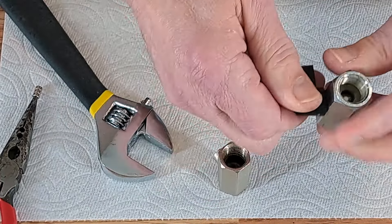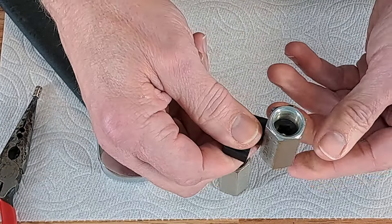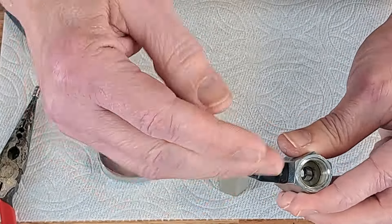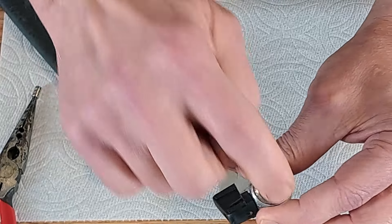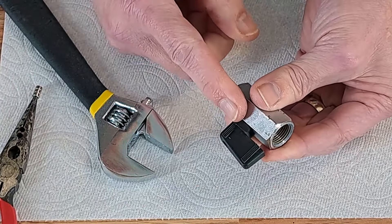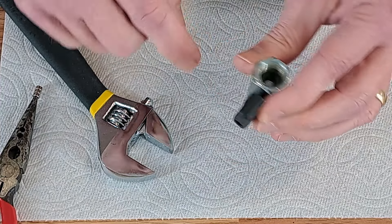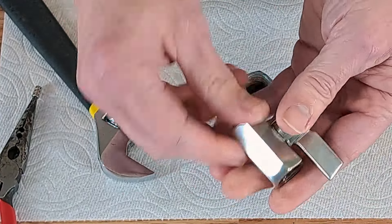Now I know one of the differences. It would also be important to make sure this is the side facing the machine, as opposed to the side where the threaded piece goes in. And also, when draining it, I should always make sure it's 100% open and never put it just partway, because that could allow liquid to get into the other spaces behind the ball area. That's why mine is still working after six and a half years, and this one failed after a little over a year — the ball is junk on that one.